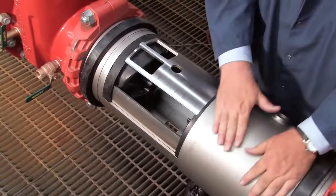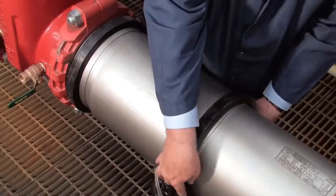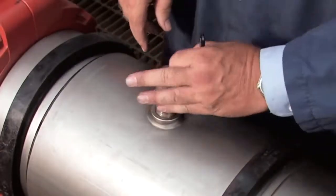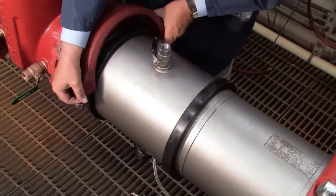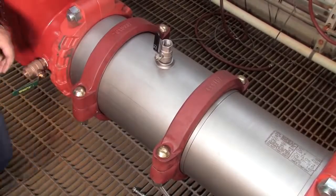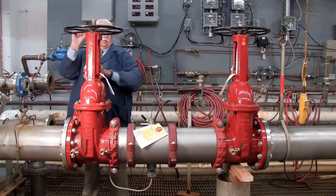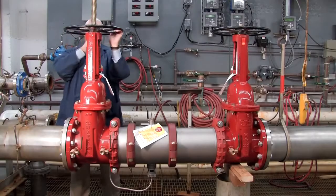With the relief valve in place, close the cover sleeve. Replace the rubber gaskets around either edge of the sleeve and re-thread the number 3 test cock. Finish rebuilding the assembly by reinstalling the two gaskets around the valve body. Tighten the bolts evenly until they make pad-to-pad contact. To restart the system, slowly open the inlet shutoff valve, close the number 2, number 3, and number 4 test cocks, and open the outlet.